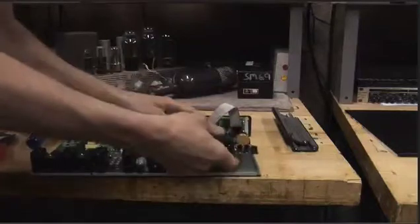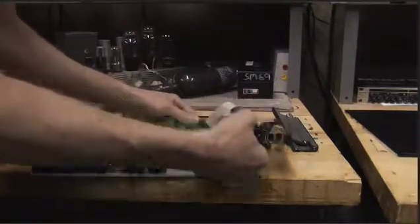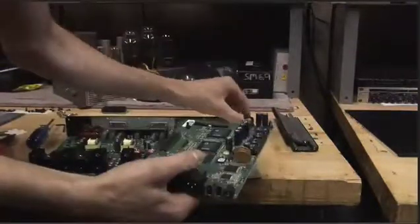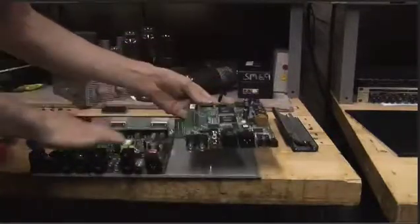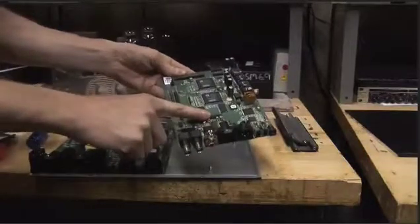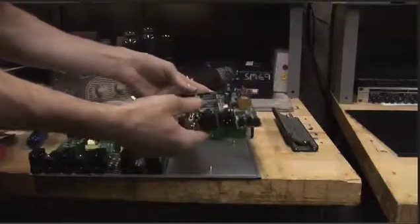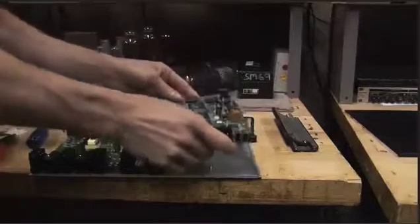Slide your hand underneath and pop each clip. There you go — slides right out. Be careful not to get your caps caught on the meter ribbon cable or anything. There's our master board. Now our 2D card is going to sit on top of this going between the two, and it's going to use all of these multi-pin connectors. We want to put on those feet underneath those connectors so that when we push down on the 2D card, we don't break this board. So let's get those feet — set this aside just for now.